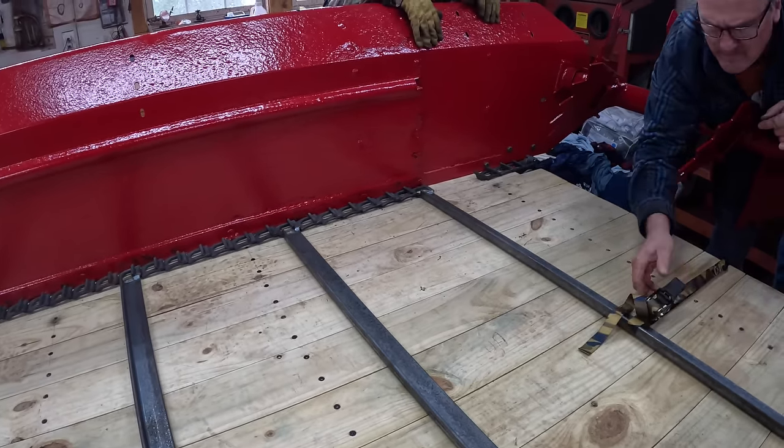Yep. Oh, I'm almost there. Here's what it looks like underneath. Just a slight droop. Remember it said 1 to 3 inches clearance from the axle. We're at about an inch now, which is good because this chain's going to stretch as it wears in. Yeah, it's a little less than an inch. It also means that as it does stretch, we've got the full amount of tensioning available up front to pull those front sprockets ahead.